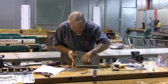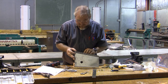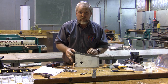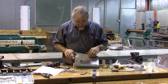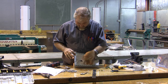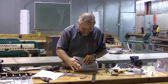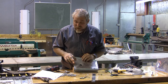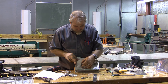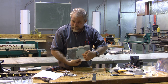This hole would have been where the damage was, and we would begin by drilling out the damaged section, and now we're going to have to splice in another section. And we're going to splice in that section per AC 43.13-1B, or also very similar to splicing it in by the Cessna Service Manual. We're going to splice it in by patching a circle behind it and putting a little filler circle inside. We need to make those two circles. And one of those circles is 1 inch in diameter, and one of those circles is 2.5 inches in diameter. They're made just the same way I made this circle, so I'm not going to show you making them.